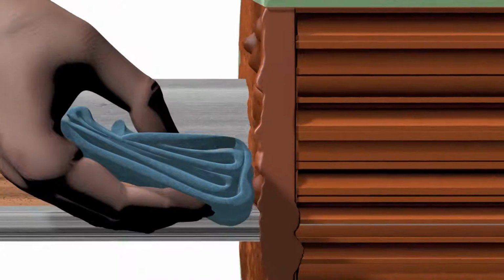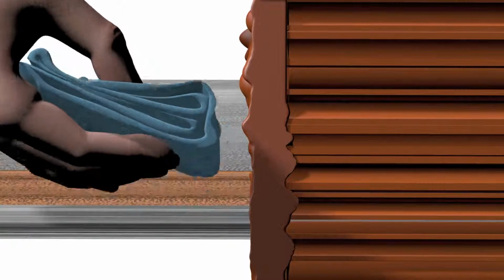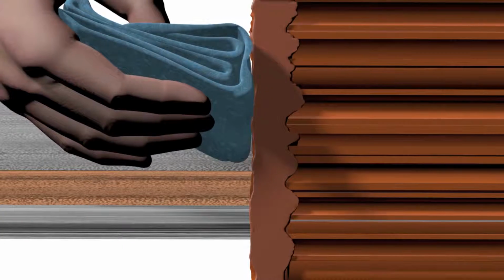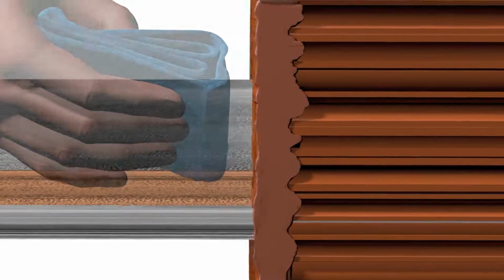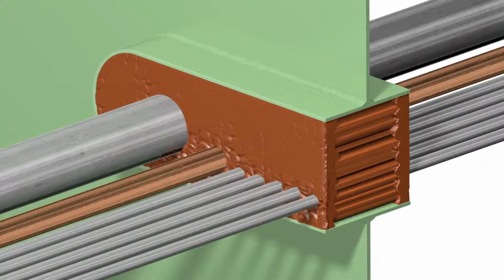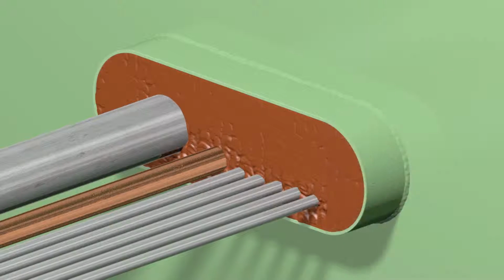It is of utmost importance to press the sealant very tightly so that it's compressed into all empty spaces in the set of NOFIRNO sleeves. The larger the adhesive surfaces of the sealant, the better the performance of the system. Due to the rapid skin formation of the sealant, smoothing should take place directly after compression of the sealant layer. As soon as skin formation takes place, a very neat smoothing of the sealant layer is not possible anymore.